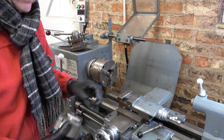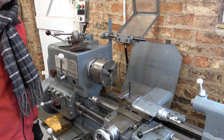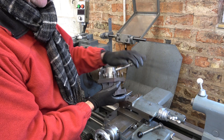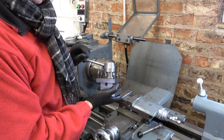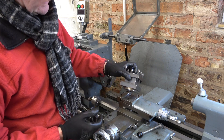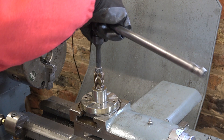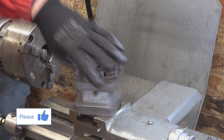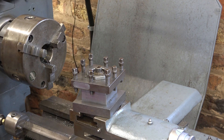There goes my phone — never do things live, folks. I realized I kept the screw with the original tool post, there it is inside. So we take this handle off, drop this on here — you can see I've clamped on the pivot — drop that on, it rotates to any position you want, put the washer on, screw the handle on.